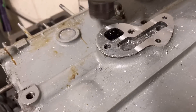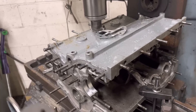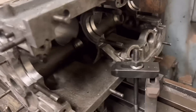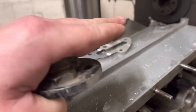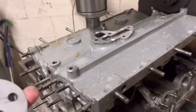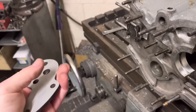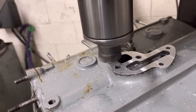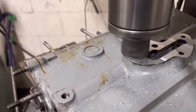The mating face was a bit rough, as was the cover, so I've faced both of them. It looks simple but in engineering terms you've got to think about the setup. I've got the height gauge and I've got this as level as I can using various jacks underneath. Once we get our heights level, we sort of get it level the other way. We're removing as little material as possible - about five thou off that face.